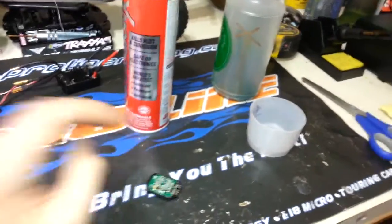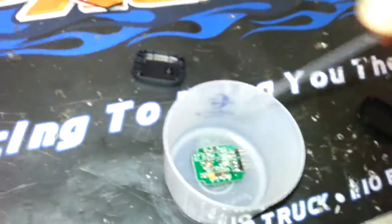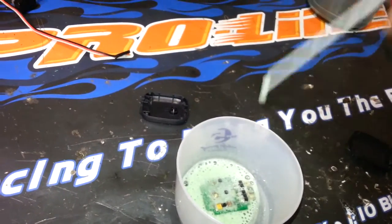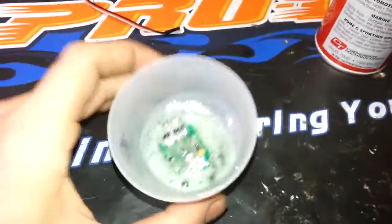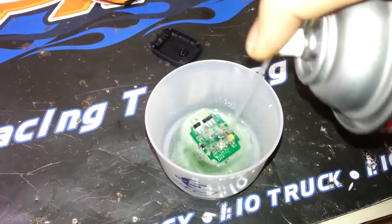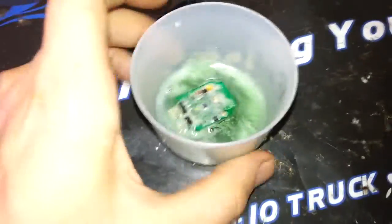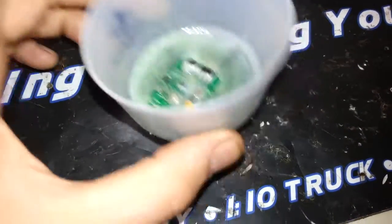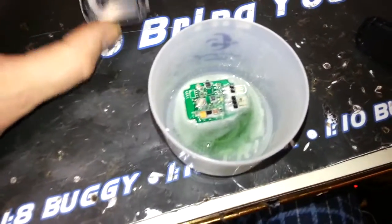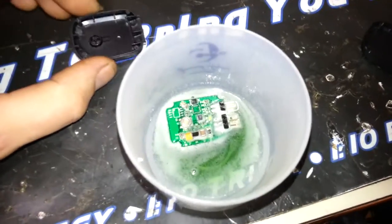This is one thing I haven't done yet, so I'll show you how we do it. Basically, this has a steel ball bearing in it — you need to shake it up for a little bit. Just drop the part in there. You'll see it'll foam up quite a bit when you spray it in, but it will settle down. Literally, that's all I need — I don't need to put any more in there. It actually attaches itself to metal and won't let go. So that's basically it — I'll let that sit. Some guys leave it for days to soak into stuff. You can do it that way, but you don't have to. Pull it out, let it drip dry for maybe a couple hours, and it will air off. A lot of it will come off, then just pop it back in the case. You can try to wipe a bit off, but the whole point is to leave some of it on there — you want it on the surface of the board to protect it from water. So don't clean it off after; you want to leave it on there.